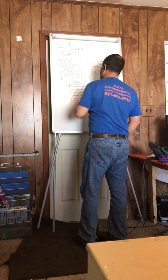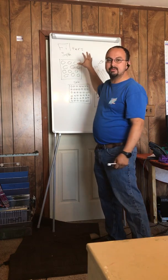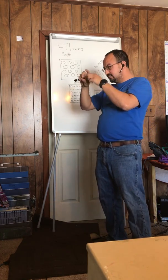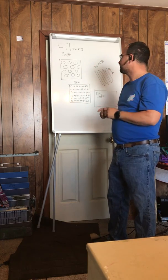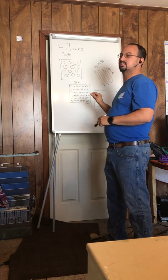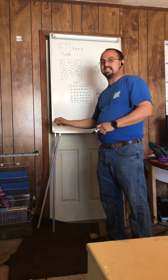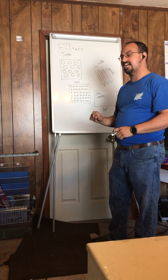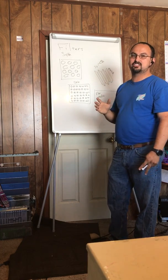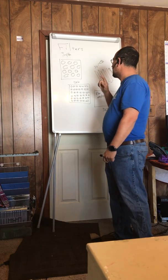So you've got an inch here. If the holes are real big, then it's going to be a lower MERV rating because bigger stuff will fit through the hole, right? We get more smaller holes, we increase the MERV rating because large particles can't get through, smaller particles can. And we keep stepping this down until we basically have a sheet of paper. So at some point in time we go, this is no longer going to work for air conditioning.